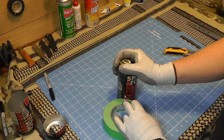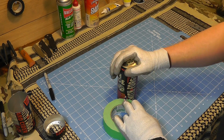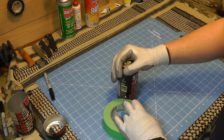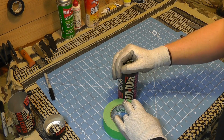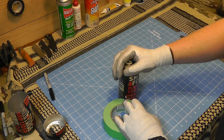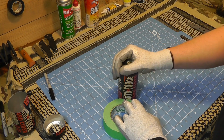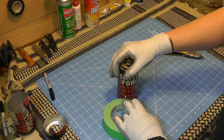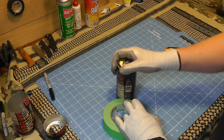So, it's important to know this height that we're using. And it's the reason why I like to use the roll of tape, because we know that this roll of tape is 1.5 inches thick. Because when we make our inner wall, that inner wall has to be 1/4 inch longer than this measurement that we're using here. So you have to know this measurement. If you cut it arbitrarily, you would have to measure it and then figure out where you're at so you know what the next one is. So it behooves you to use something of a known dimension for this.